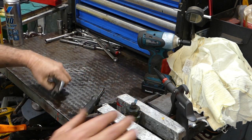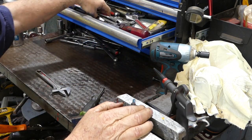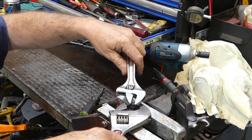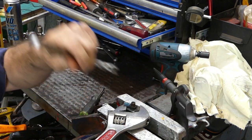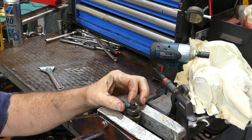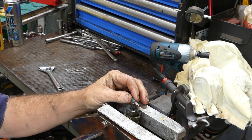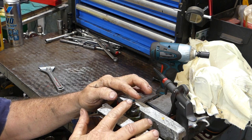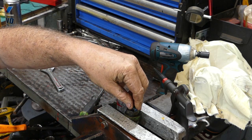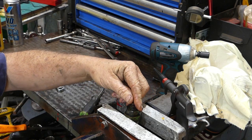The 30 series has a little oil sensor here. I'll just grab my fiddle here and loosen that off. It has a little wire that takes a signal up to the dash light. On the 2030 series — I think the 20, but definitely the 30 series has this. With the 40 series and the 50 series, they don't have a wire on here, but they have a pressure sensor in your shift cover, not your lift cover. The other tractors don't have this, but the 30 series does on the Mannheim — so I think 1830, 2030, 2130.